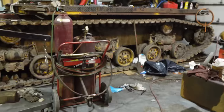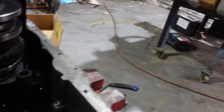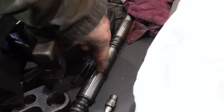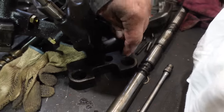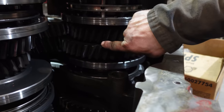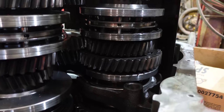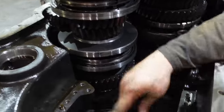So, you had to get the shifter forks out. Yeah. To do that, there's this little block that connects the two. It's like a detent block, so you can only shift one, and then the other. And you've got to drive the pins out of that. You got this one here. You've got to get it high enough so that you can get it over top of this gear, and drive the pin out. Then you just slide the rails out. Top forks fall out, and then you've got to take